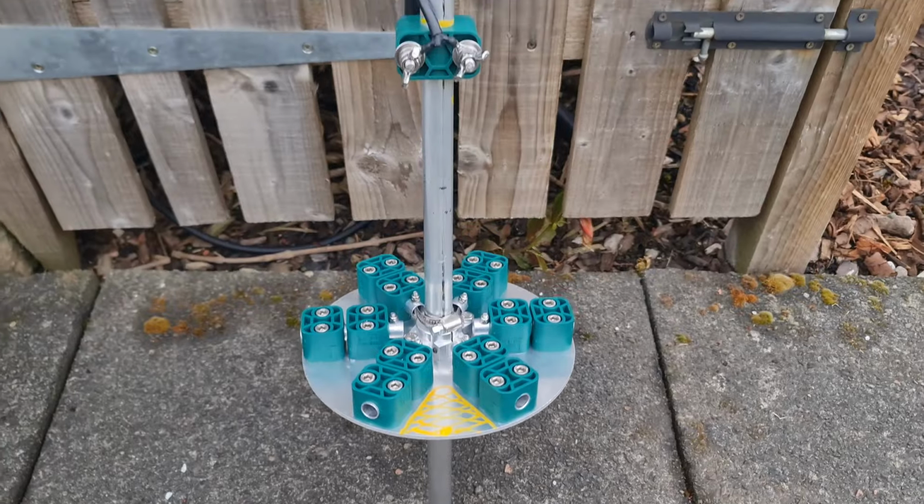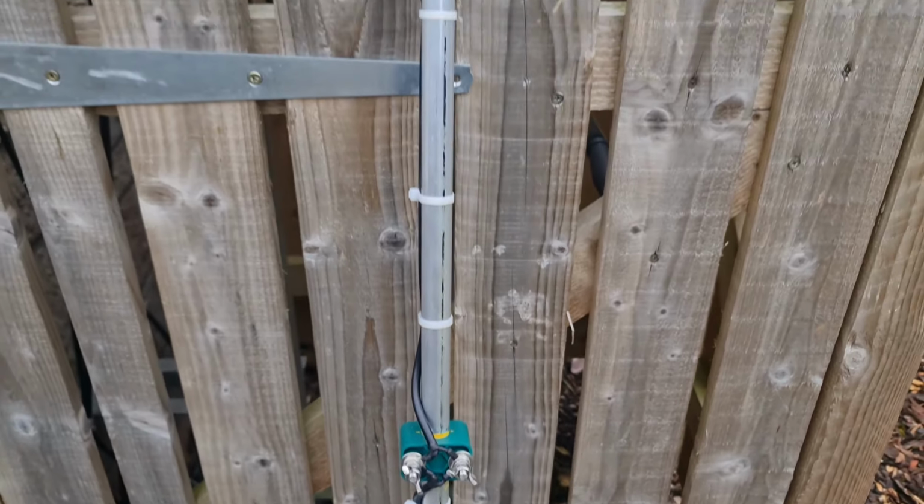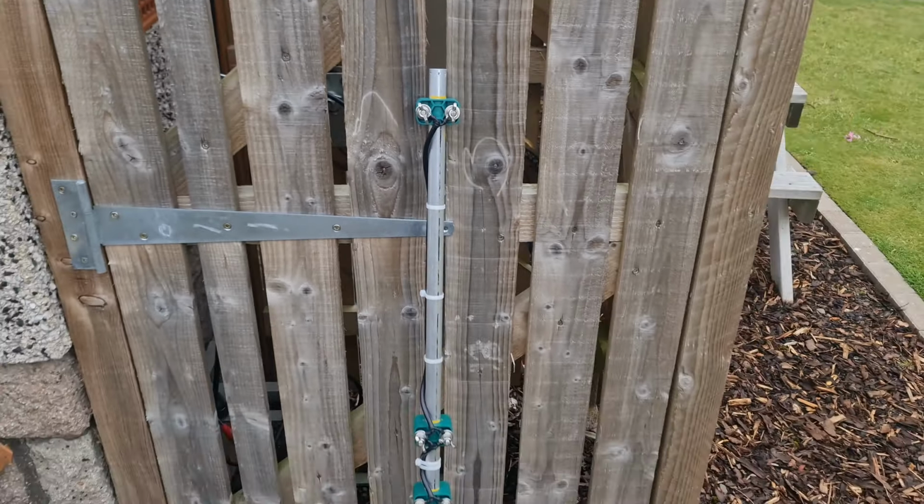So I've got some rough notes here, and I'm just going to go through these, and I might think of some others as I go along. So I'll start with the center post, and that's the bit in the middle. Everything connects there: your wires connect to there, your coax connects to there. So I opted for the simple coax fed, where we have coax jumpers, and I just went with the 5-band. I didn't go with 6 meters, but I can add it. For very little additional cost, probably literally less than £5, I could add 6 meters. But yeah, I went with the coax method, as specified by K4KIO Leo, and it's worked absolutely fine.